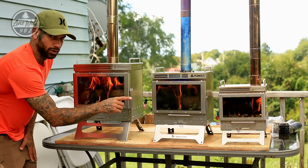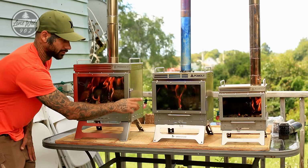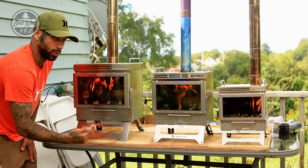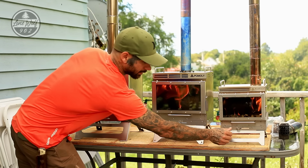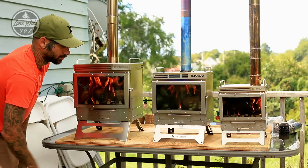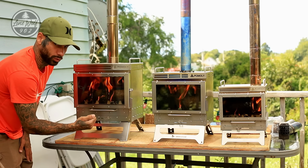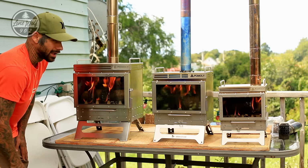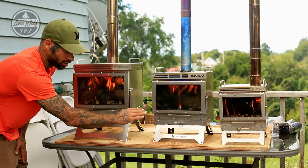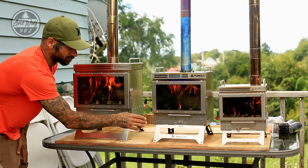The little guy will burn very, very strong wide open, just like the other stove of this model with no damper. It's basically full on or half off if you want to manipulate the bottom control. It is very responsive on all of these stoves, and the only way you could take out the ash pan is by opening the door, so keep that in mind as well. I have found that with this size stove I can burn it all night long and not have to worry about dumping the ash pan until the next day. It does burn really well.